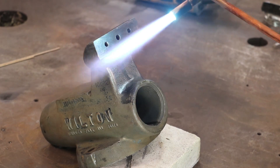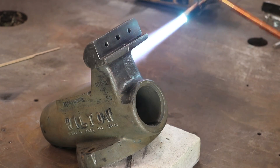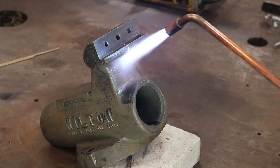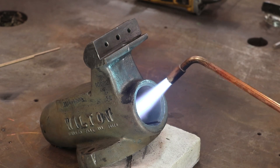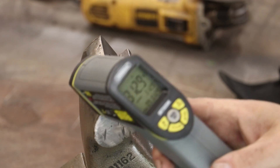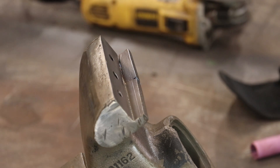We got a rosebud tip on here and we're just going to take our time heating it up, get it up a couple hundred degrees. Not trying to get in a hurry - I'm not trying to direct a bunch of heat in one area. We're trying to heat it up fairly evenly across the entire part. We'll be back in a little bit. I'm hitting this with my infrared thermometer and we're reading a little over 300 degrees up here on the top, so that should be a little bit of a preheat. The idea is just get some heat in there so when we come in here with this TIG, we're applying a tremendous amount of heat in a very small area, and I just want some heat already in there so things don't go crazy expanding and contracting and causing the crack to be worse than it already is.